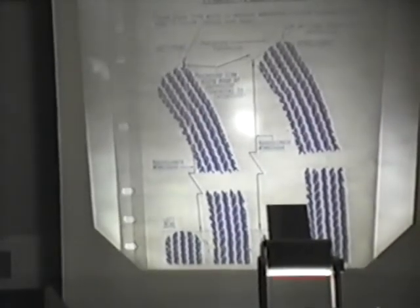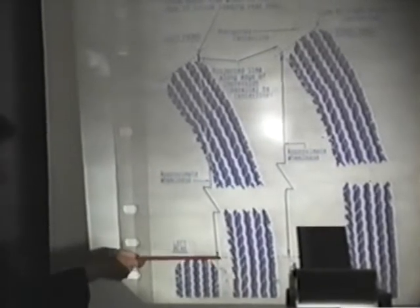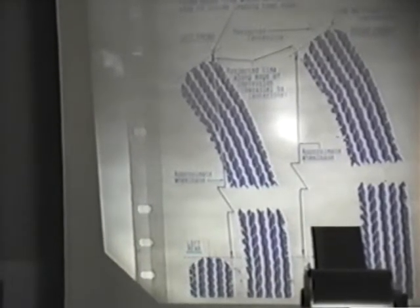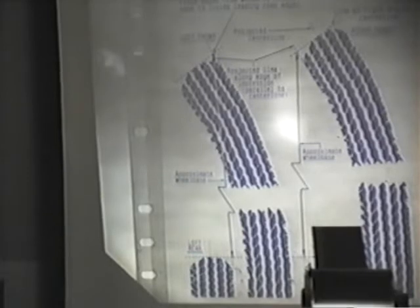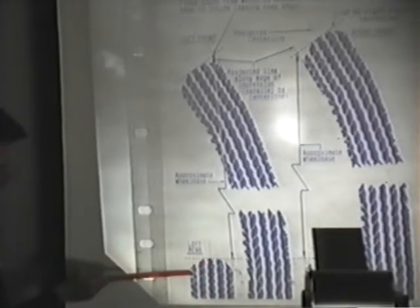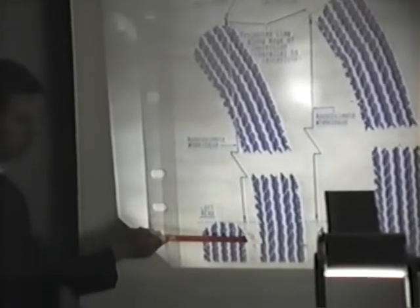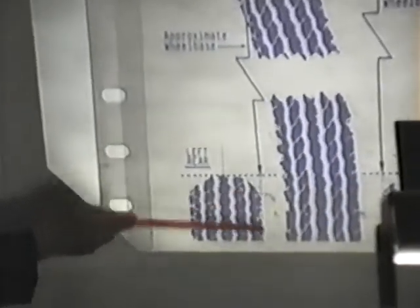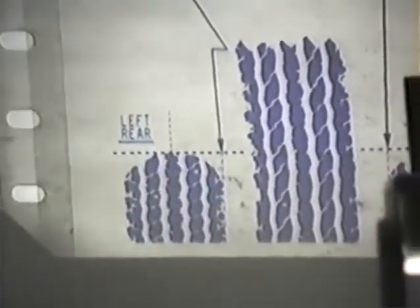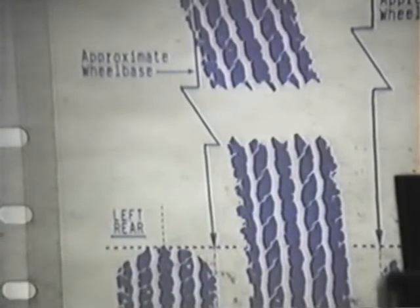I'll ask the person assisting me to hold the zero on the tape right on that spot. And I'll watch them when they do it to make sure that they do it. Now, if I didn't have this spot, the person could pick anywhere along here to hold the tape. They could hold it over here, they could hold it here, anywhere back here, because that's where they see it stopping. So if they don't realize how particular you are and how accurate you're trying to get, they could plunk that thing down anywhere. So you give them this spot and show them that one can hold it right there, and then they plunk the zero on the tape down right there.